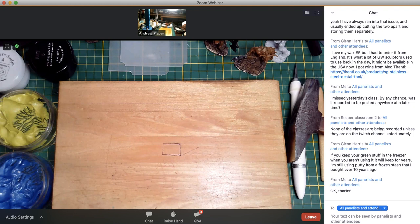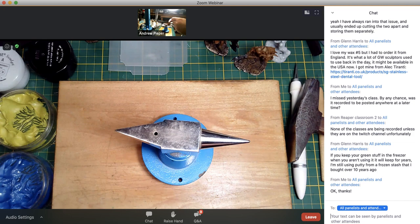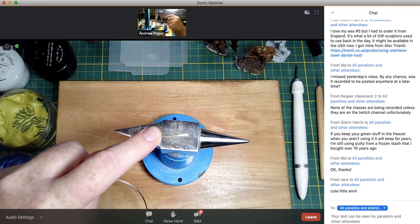Yes, I like copper because it has ductile properties that aluminum does not have. It's primarily its malleability, because I can take the copper on my jeweler's anvil, and this is the next tool, and take my forge hammer, and copper moves. And aluminum is not as predictable on a forge. So I can forge this real easy without having to really think about it. And we will be forging today.